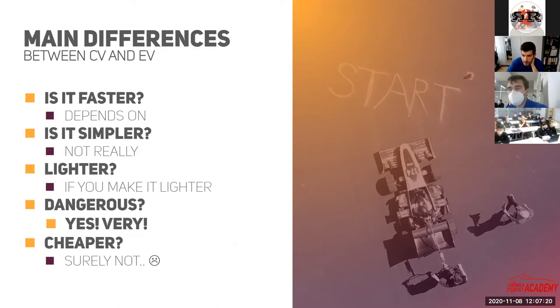You have other kinds of thermal issues and hazards than in a combustion engine car. For example, you don't have to take care of flammable fuel, but you have to watch your batteries and keep them inside the safe operation area. Is an electrical car lighter? We have seen light and heavy electrical cars, and light and heavy combustion engine cars as well. It boils down to how you design the car. The drivetrain is not inherently superior — you have to design the whole package on a system level.